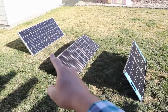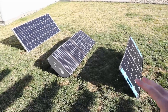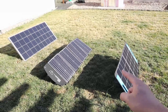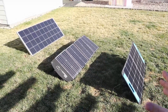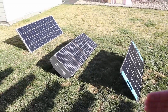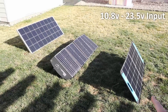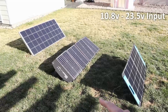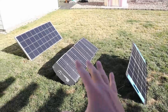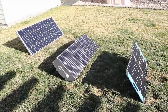In this video I demonstrated you can use a glass rigid panel or folding solar panels. If we used a 60 watt panel, we'd be getting around 40 watts with the high clouds today. By over-paneling with larger solar panels, we can hit max power more frequently. The power station limits to 3 amps, so as long as your input voltage is correct, you're not going to damage the power station using larger panels. The power station pulls the power it needs, and with extra capacity available, you can still get full power even with high clouds or haze.